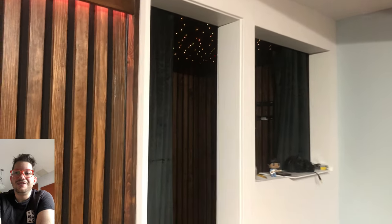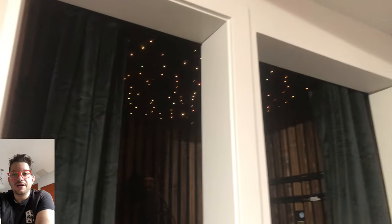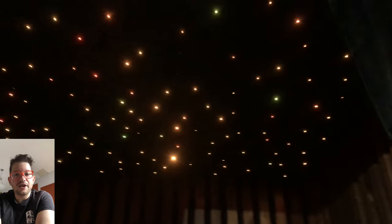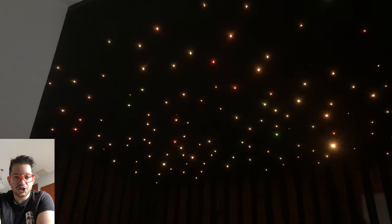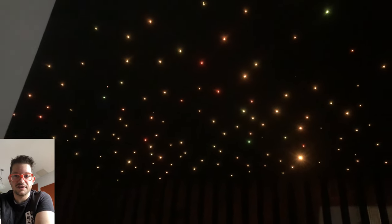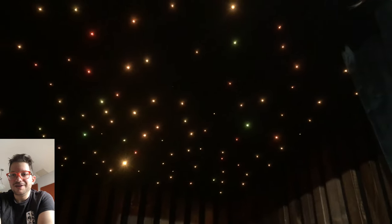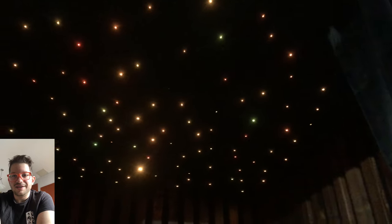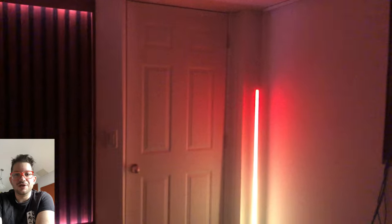Here is a clip of the finished product. Another tip: cut those filaments slightly proud of the fabric and then push the filament back so it sits very flush with the visible face of the star ceiling panel. You can see just a random pattern here — turned out really nice. This light engine also shoots out random patterns so it ends up looking more natural, like a real star ceiling.